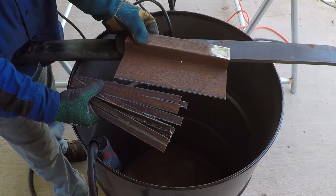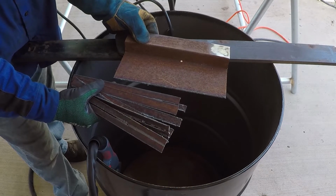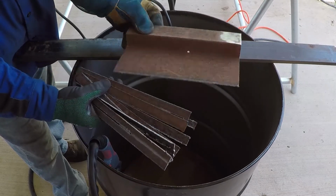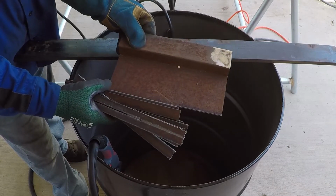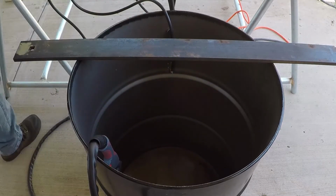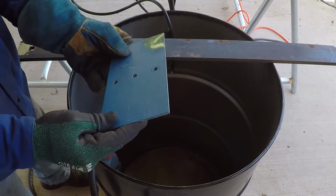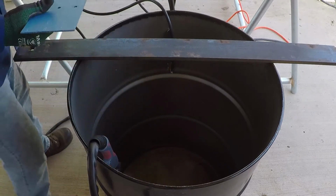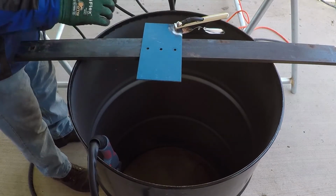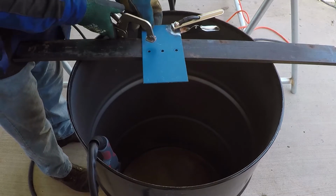This machine will cut fine with the setting between 40 to 55 on 120 volt, 16 gauge sheet metal with a lot of rust on it. Let me try to use different thickness steel and cut with it on 120. This one over here is 1/8 inch sheet metal and it's painted. I cleaned the area where I connect the ground or the work clamp.